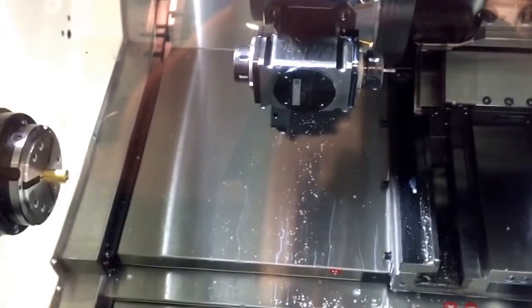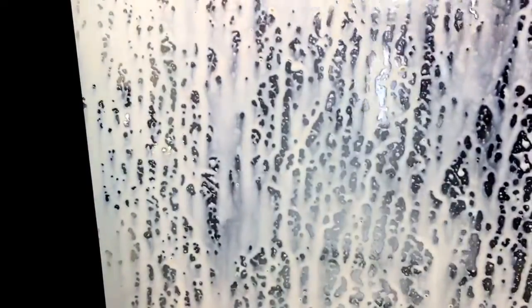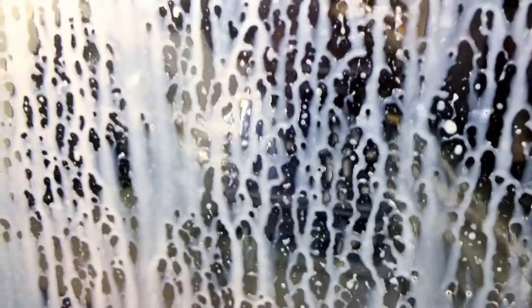Some of the operations are incredibly fast. That's a compressor — I'm going to stop for a second. Now that the compressor is off, we can go ahead and run the program. See what's doing — a facing operation. High pressure coolant obviously already screwing up the view. This is amazing if you can see what's going on. Doing a 2.2 inch drill in less than 3 seconds — pretty awesome. This is a boring bar doing the interior arc and creating a nice plate for threads to go on. That was a rough pass; this is the finish pass.